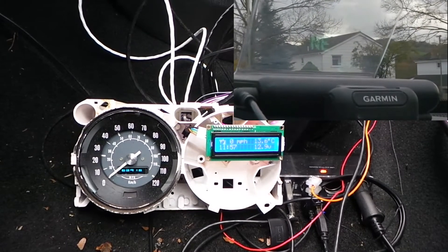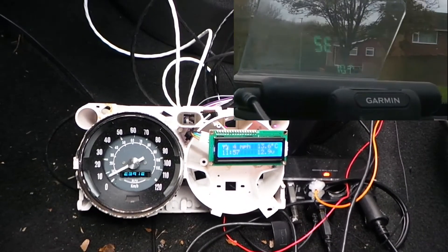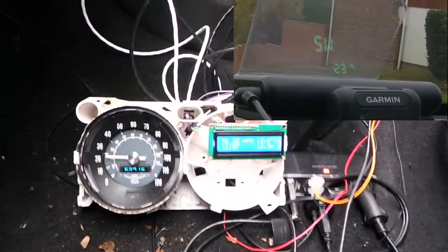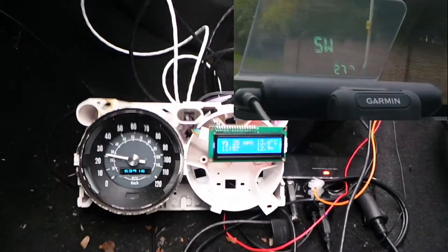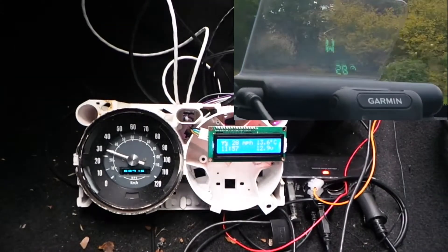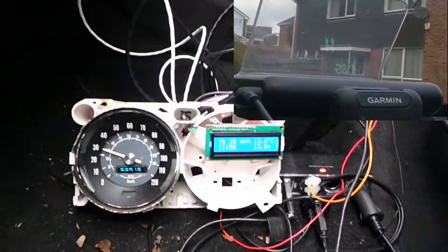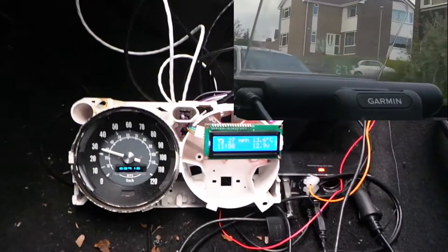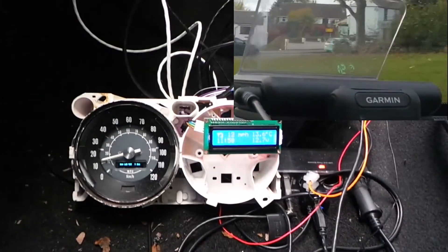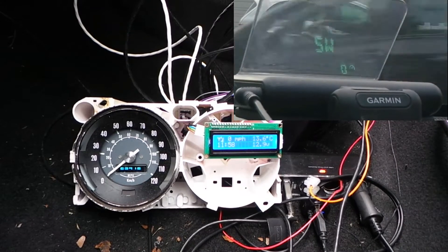Right, let's move off. What the needle's actually doing now is: the GPS is still commanding the needle position, but it gives it a target position, and the distance between the current needle position and the target position defines the speed at which the needle moves. This eliminates that integer jitter without having to resort to floating point speeds, which I found produced just as much jitter.